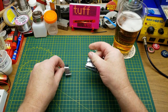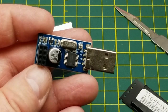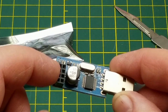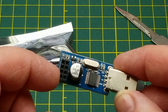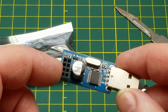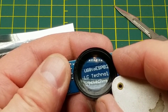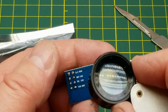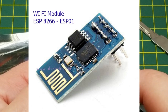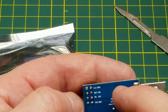What is this USB guy here? Let's start with that. Looks like some sort of USB to serial. I'm wondering if that matches the pinouts of either the basic ESP8266 or maybe the NRF board. Yes it does — USB to ESP8266. So that's for the basic ESP8266; it's just got Wi-Fi on one side and a serial port on the other side.